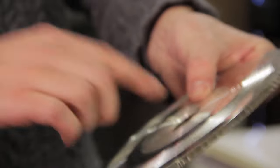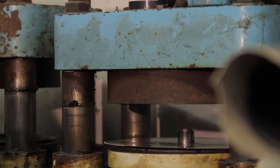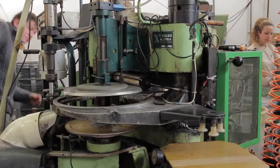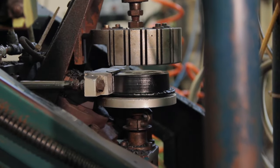Because like a medal a disc has two sides, this whole process — from cutting the lacquer to making the stamper and its positive copy — is repeated two times for the two sides of the final disc. When the stampers are ready they are carried to the press department. The machine performs multiple operations at once: on one side it receives through a hopper PVC pellets — polyvinyl chloride — that are melted down and extruded into a noodle. The noodle is cut at a precise length, precisely dosed, and pressed into the shape of a puck.